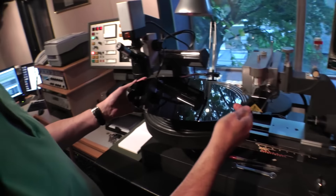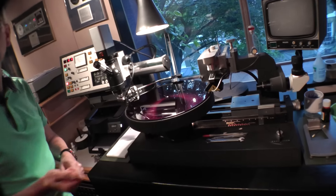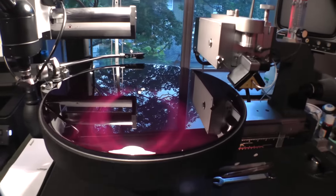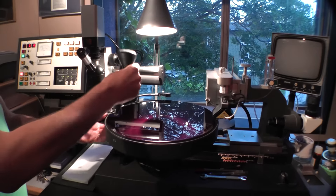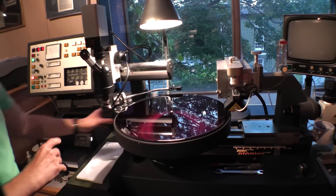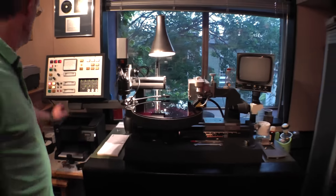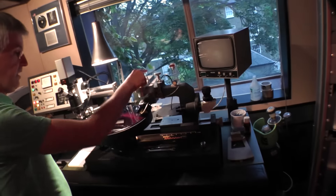That's what the vinyl looks like before it's all cut. This isn't vinyl - this is an aluminium disc. You might just be able to see the metal in the middle there. Coated in nitrocellulose - it's like semi-dry paint. That's the same stuff that they put on Fender Strats - nitrocellulose, although it's illegal in California now to use that on guitars. Well, you can use it, but the emissions at the plant are all very tightly controlled. So that's a fresh master disc - a fresh lacquer, which is the master. It starts on this. This is bigger than a normal record - this is 14 inches. I'll do a little test cut on the edge here, just check it all looks right. If it does, we're going to go for it.